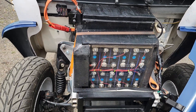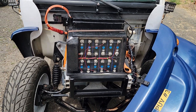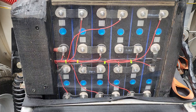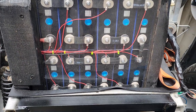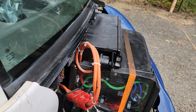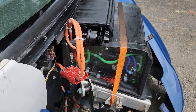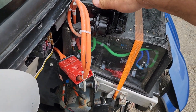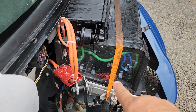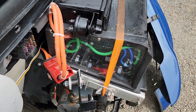Part of the reason the hood doesn't close all the way — it's close. I've got the BMS, you can see all the red wires wired in front and back. So this is 36 volts and 36 volts — 12s plus 12s — all with one BMS and connected together in series.